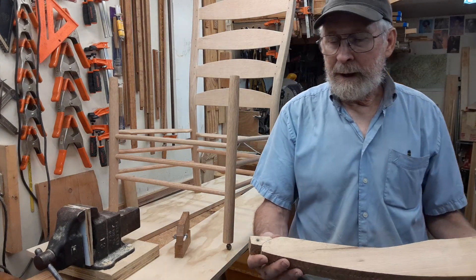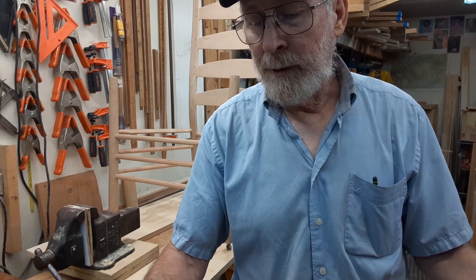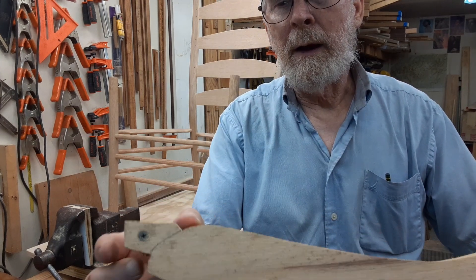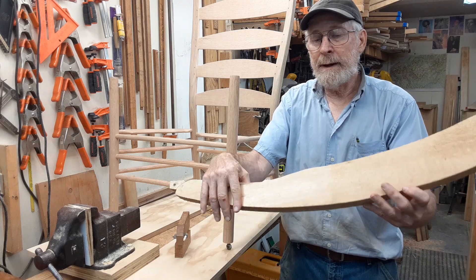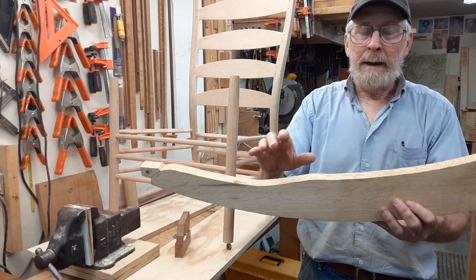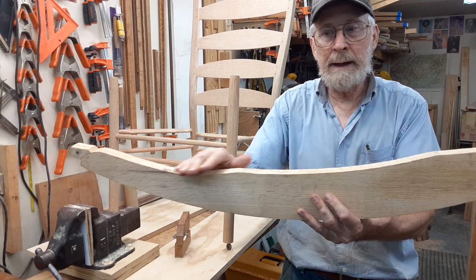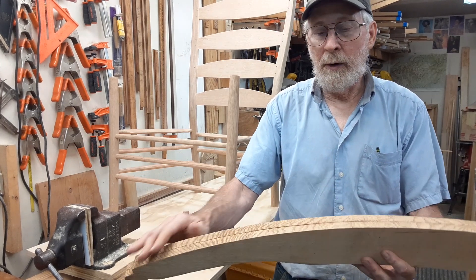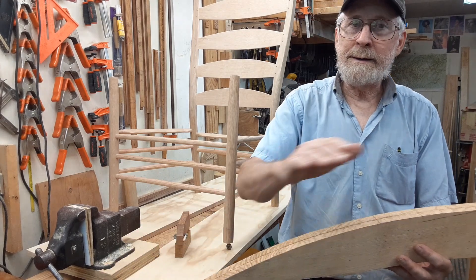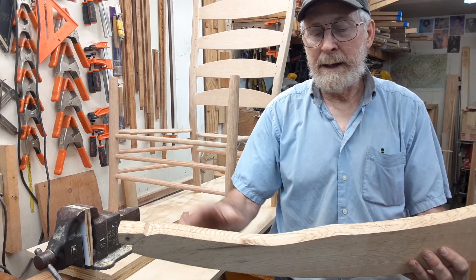This is a set of rockers already cut out. I put them together — I screw them together — and you can see where I've put the screws outside of the lines, so I can cut up close to there and do all my finish work getting these smoothed up, and they'll be pretty identical. It's important that this spot and this spot be in line with each other — like with a straight edge — and then this whole bottom needs to be completely smooth in a smooth radius. Those are the critical places; other than that, they could be any shape you wanted.